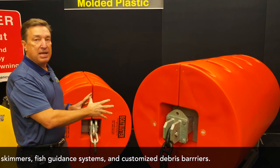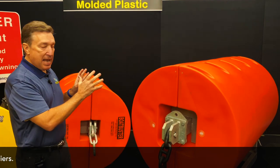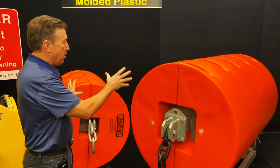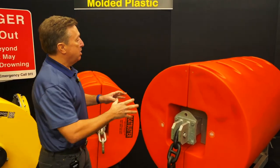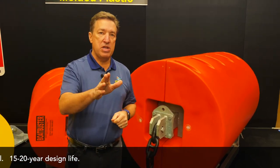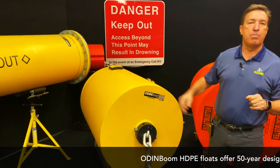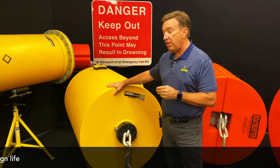This design is not like a typical barrel float or buoy — it's far from that. This is an engineered product with a tremendous amount of versatility and longevity. The Boat Buster is part of our roto-molded series, meaning the outer shell is made using a rotational molding process and then filled with foam. The life you'll get on this barrier is generally about 15 to 20 years. We also have a newer version called our Odinboom series, made from HDPE pipe, where you can expect about a 50 year lifespan — but that's covered in another video.